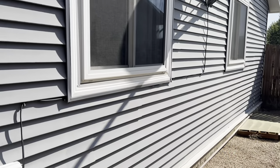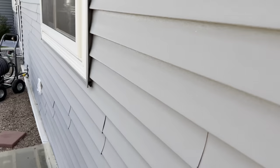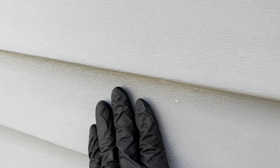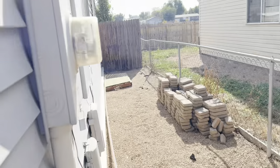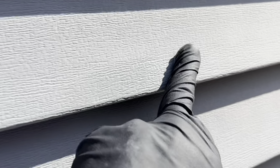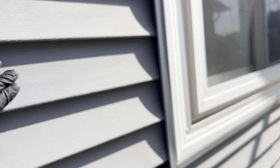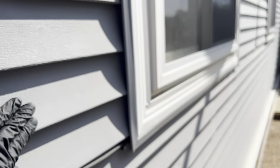So I'm on the south side of the home here. In the shaded area it presents as a pretty, kind of lighter, not too dark blue home. But you get around the side here, it's almost like a bluish white, and it's really because of this oxidation. I don't know if that's coming up on camera, but that's actually a darker blue just rubbed off my finger — just this nice powdery coat. You guys that are in the field working on this stuff know how intense this oxidation can be. This side's pretty heavily oxidized, not surprising.